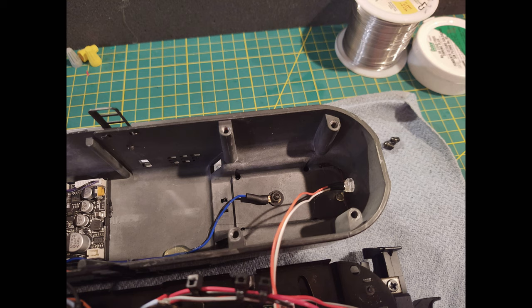On the right side of the shell you can see a blue wire running to a terminal on the shell. That terminal goes through the shell through a little plastic insulator up to the pantograph. On this engine the pantograph is insulated from the rest of the shell and frame, so I decided to use it as the TMCC antenna — it's insulated and won't ground out to anything and cause signal issues. So the pantograph is the antenna, which is really cool. You don't see that very often, and it works really well. The pantographs are not motorized but still go up and down even with that connected.